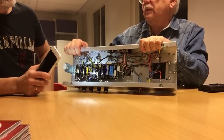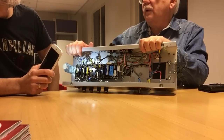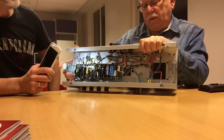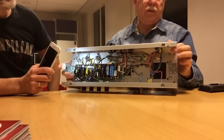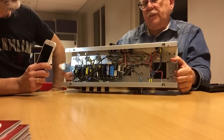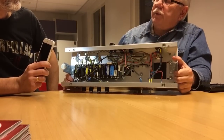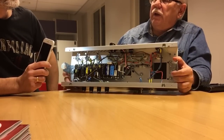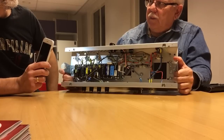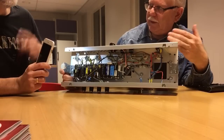But I know of some old Marshall amps that have the transformers placed in different ways in relation to each other, which has an influence on both tone and noise level. Is it an actual phenomenon that it really has an effect on tone? Placement of output transformer relative to power transformer. Yeah, it will have an influence on hum, because of the magnetic field from transformers. But on tone itself?